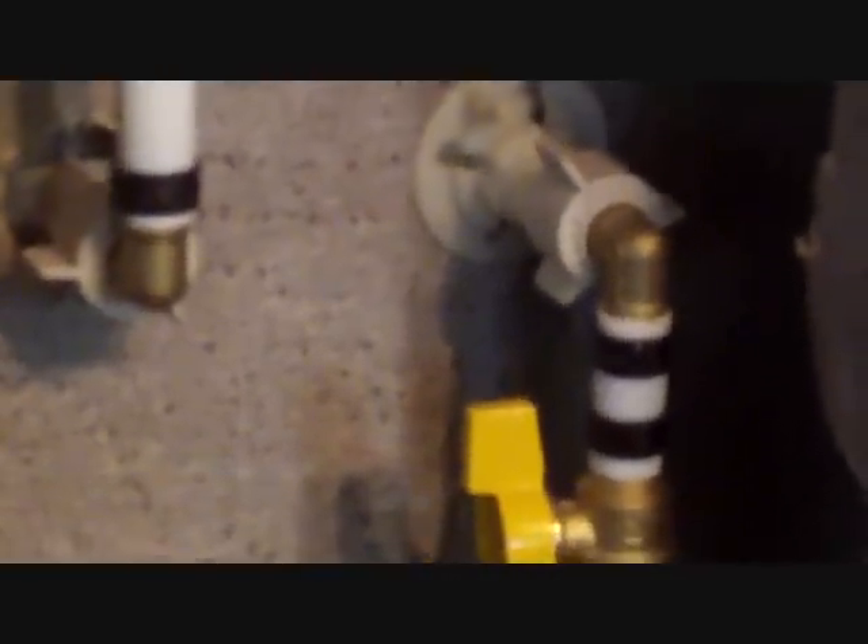They're so easy to do. A few extra connections really don't bother me any. And most often, like in this case, they had active leaks. So what I try to do is get in to the places where they've got active leaks, get under their sinks and under their toilets, tubs, showers and stuff from up above, go ahead and go poly to PEX, get that running and stop those leaks quickly so they can keep water running — they're not without water very long. Then I can go back underneath and finish the runs, run it straight up to where the poly-to-PEX connection was, cut it off, put a PEX-to-PEX fitting in there, and then they're good to go.